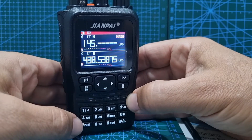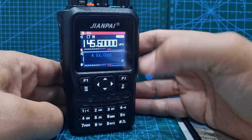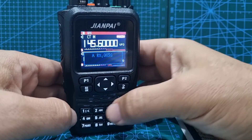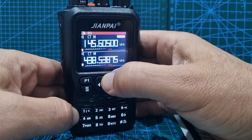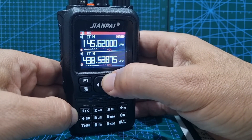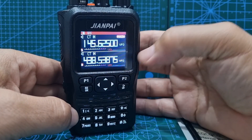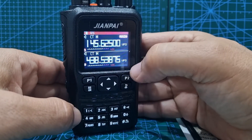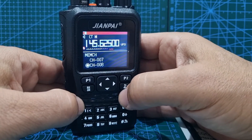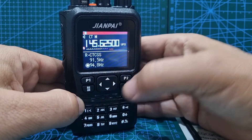We're going to enter the output — that's the receiving memory, the frequency you listen on. You can see it's busy so I'll go up a couple. We'll go to 145.250 — actually let's use 145.625. So 145.625 is our receiving memory frequency. Next we go into the menu and set the CTCSS tone.